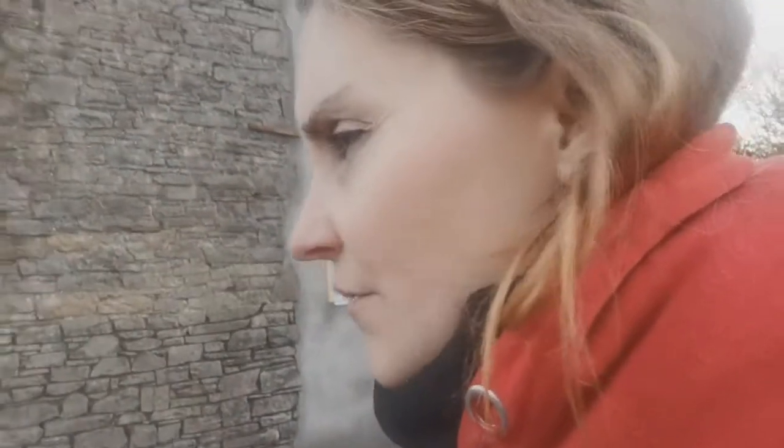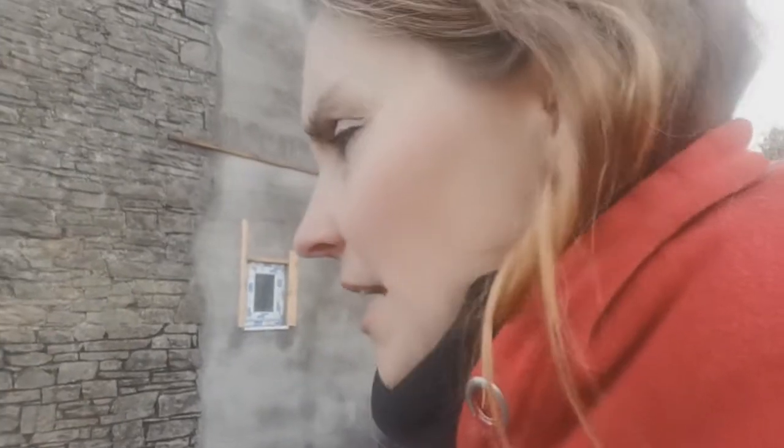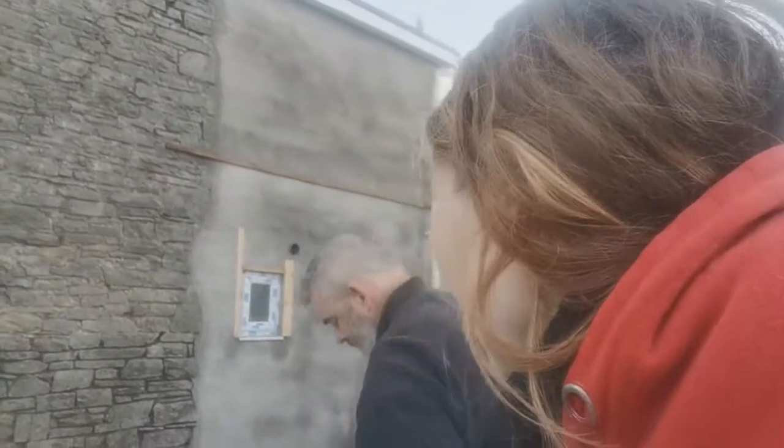I thought I'd say, maybe I haven't said it before, with this mix for repointing you've got to get it right, and it's got to mix for a while in the mixer because it doesn't work properly in the pointing gun otherwise. And it's harder work and the gun gets stuck and it's just crap.